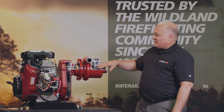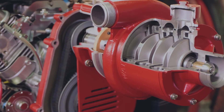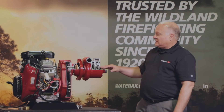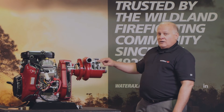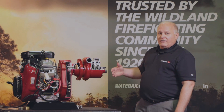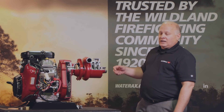All the product here — the suction cover, the pump body, the impellers — they're all anodized aluminum, so it's corrosion resistant. You have aluminum impellers, not bronze, so under harsh water conditions you don't have galvanic corrosion taking place between the pump body and the impellers.